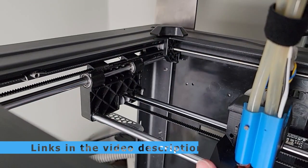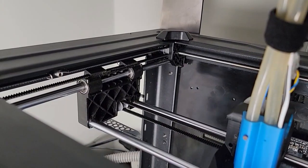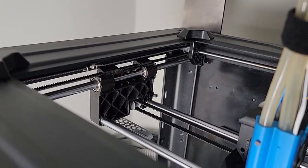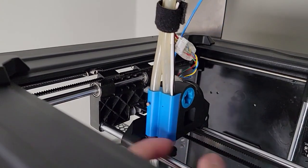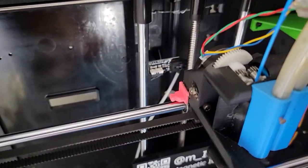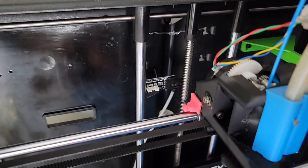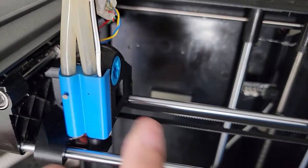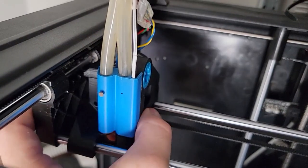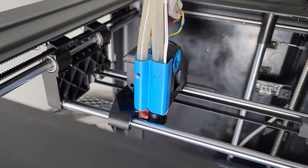So this is my little push-push. It fits right inside here. It's not lit well enough, but you can see the push-push latch. I just literally pressed it into the y-axis block and printed a tiny little piece like this. I used to have a magnet here to keep the tool parked. So it's free to move, and then it latches, and it's solid. I can't pull it out. Push to release, push to latch. And that's enough to do tool changes.